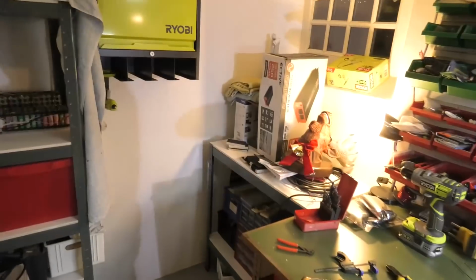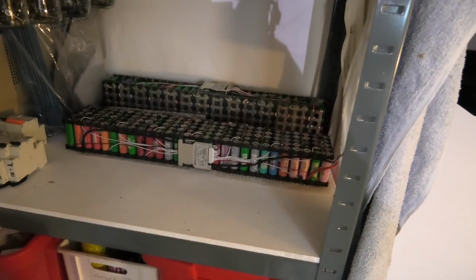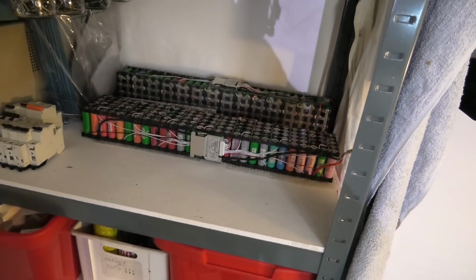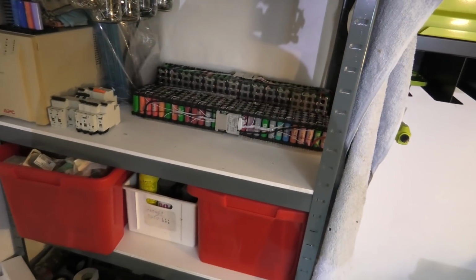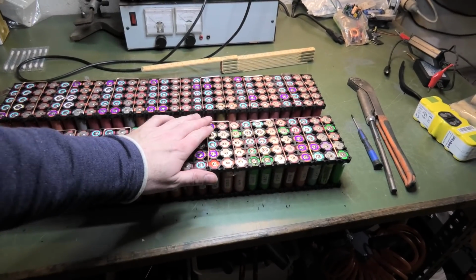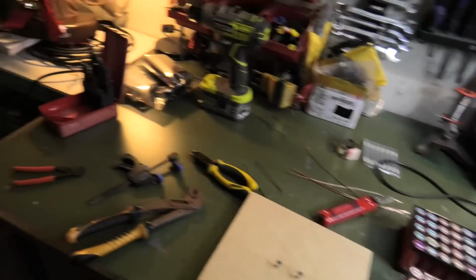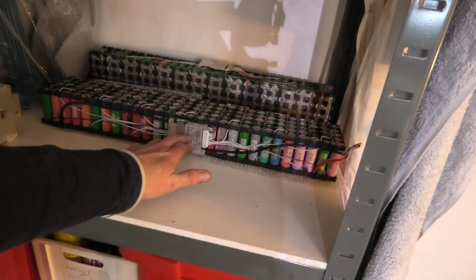So yeah, when I have 4 batteries done, I can connect them to an inverter. Two batteries is not enough for the inverter and the capacity and stuff that I want to do. It could become too big of a string on it, so I really need four. I am planning that these battery banks are not going to be delivering very high current. The maximum amount of current that I want to see out of these is about 15 amps, because that's also what the BMSs are. They are also 15 amp BMSs.